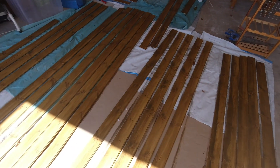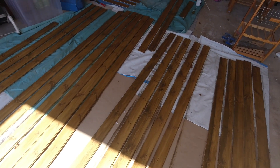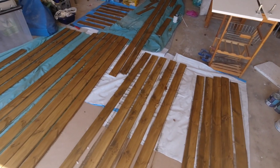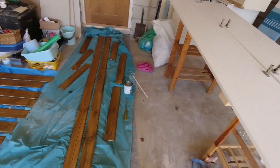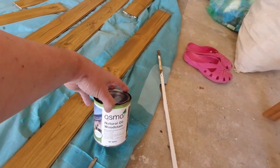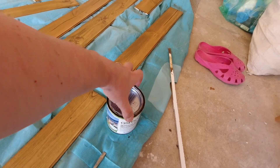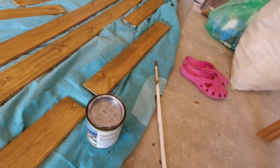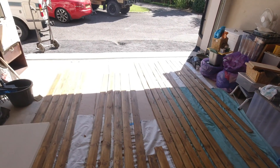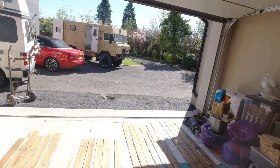The tip I've got to pass on is: stain it now. Don't stain it when it's in because it will contract and expand with the heat and that will show off white bits if it contracts enough. After much searching, the stain I went with is actually for outside use, so I figured that would be good for the camper van in case it gets damp from cooking and so on. That's going to get fixed to the wooden battens put up inside with a nail gun.